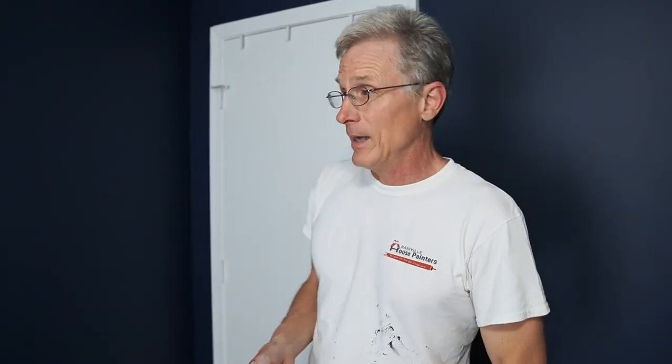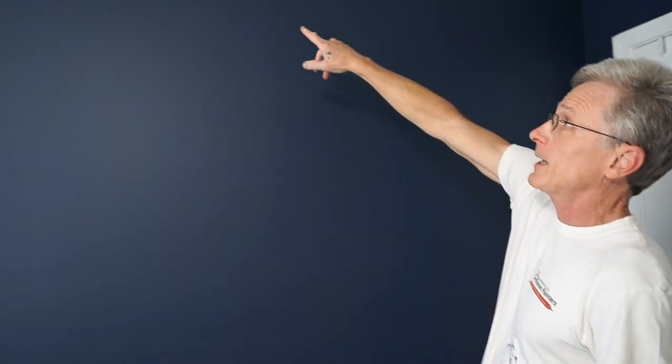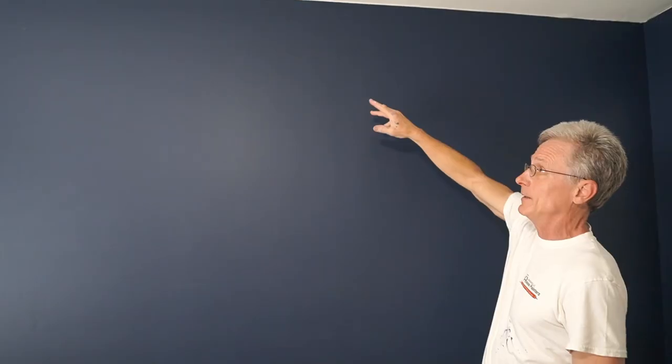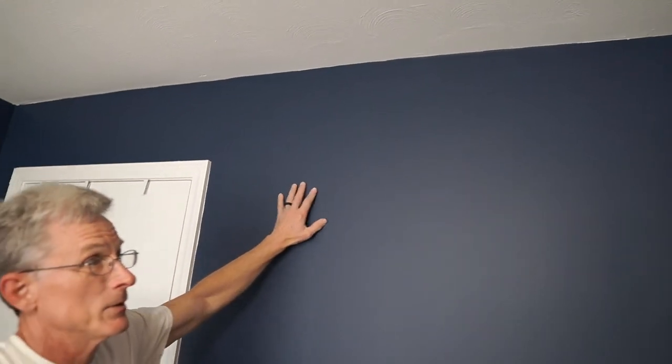We're back and done. This is the Sherwin-Williams Emerald Matte finish and that's what I recommend for dark colors. Normally with a dark color you need somebody rolling and cutting in at the same time to avoid hat banding — and there's no hat band here at all. This paint also touches up really well; if you miss a spot you can go back in after it dries. Normally dark colors won't touch up, but with Emerald it does. I couldn't recommend it highly enough. Thanks, see you next time.